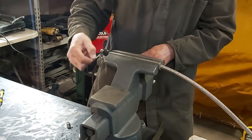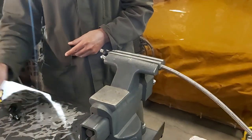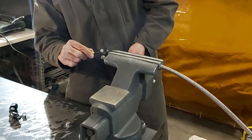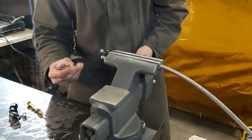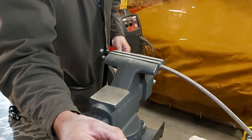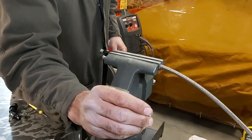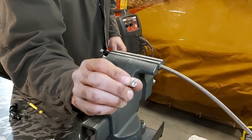Take your tape off like so. Then this part here — what you have to do is actually open the end up a little bit so we can get our ferrule on. As you can see, that's our little ferrule — it's actually got a lip in there. What you want to do is push the ferrule onto the PTFE line inside here, all the way up to that lip so it seats properly.